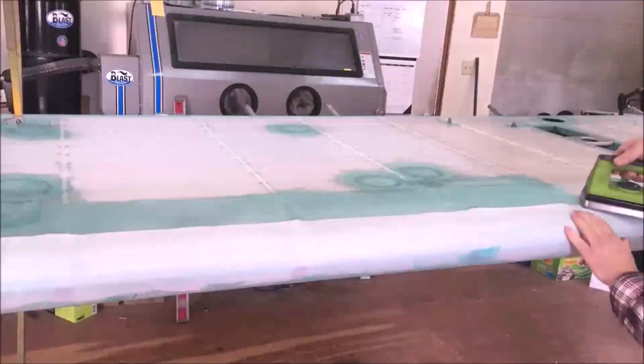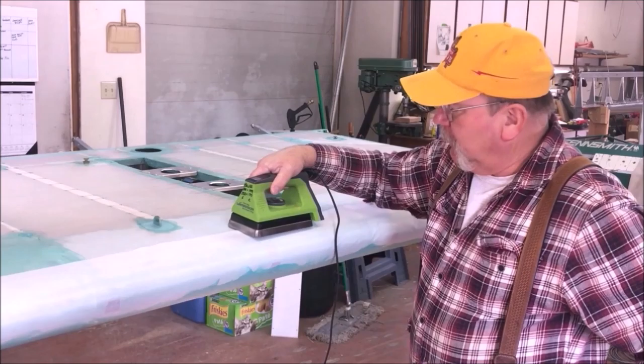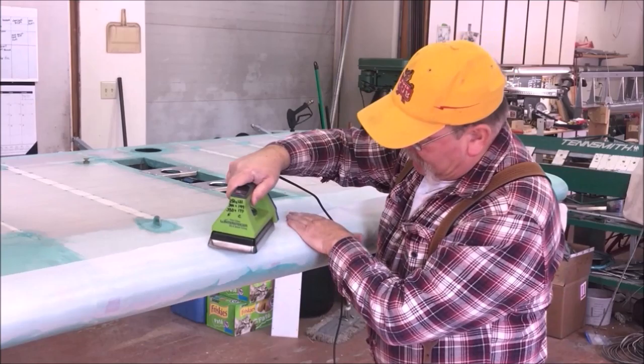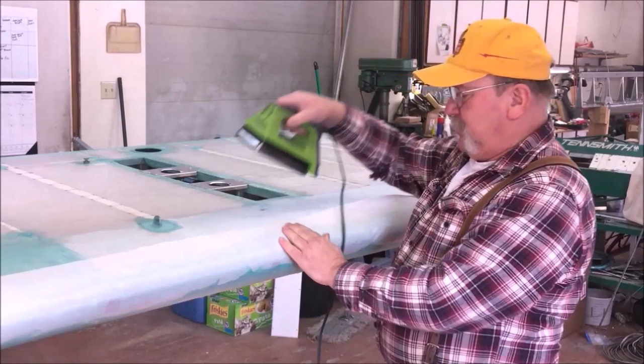You can see I'm not shrinking necessarily in any big amount. My iron can sit here for quite a while at 220 degrees. All it'll do is remove the slightest of wrinkles. And especially on a leading edge, because you get a lot of heat transfer, it sucks a lot of heat out of this iron. So we're not trying to shrink the fabric. We don't want to shrink this fabric too much right now,